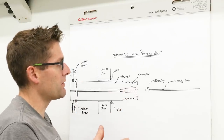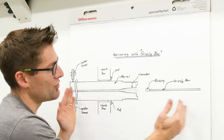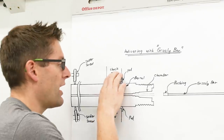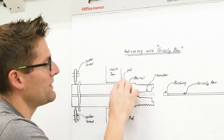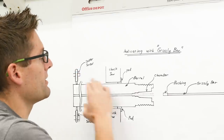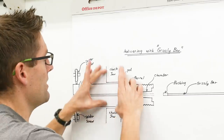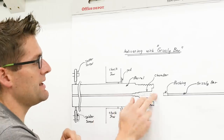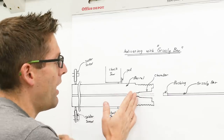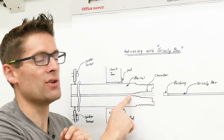I've got the Precision Matthews PM1440GT lathe with a two inch through spindle capacity, and I also built an outboard spider. The lathe has a shorter headstock which is really nice because it can accommodate shorter barrels going through the headstock. I've got a four jaw chuck on the other side using pads. When you tighten the chuck jaws with these narrow pads against the barrel blank it enables the barrel to pivot slightly, so you can use the outboard spider to adjust the angle up or down and left and right, and do radial adjustments with the chuck jaws themselves. The goal is to get the key sections of the barrel bore running perfectly true with the lathe spindle — specifically a perfectly concentric neck area of the chamber and the freebore as it transitions into the rifled section.